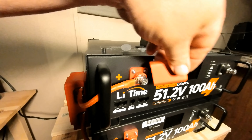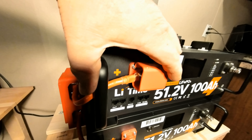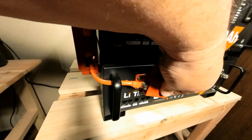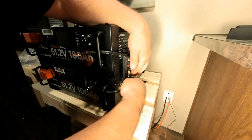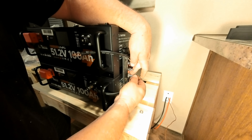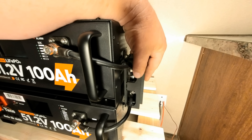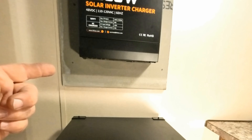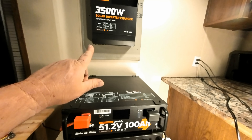Here are the caps that come with the battery that protect the wiring and protect you from getting shocked. We'll go ahead and slap this negative on real quick after we shorten the wires up, crimp some new ends onto them. We'll go ahead and slap our cover back on. Next is going to be to run the wiring up here to the breaker switch and then the breaker switch to the inverter.